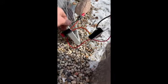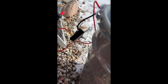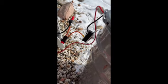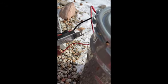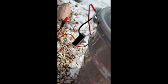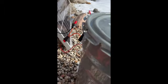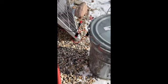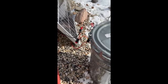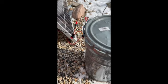So playing smart, I put in an inline fuse, 10 amp, and then using a 120 volt switch, which is totally safe because I'm only running 48 volts through a 120 volt switch, and amperage coming out of this at high output with the resistance. The hot water tank heating outlet that I use is a 120 volt 1500 watt capable. It runs 10.8 ohms of resistance.